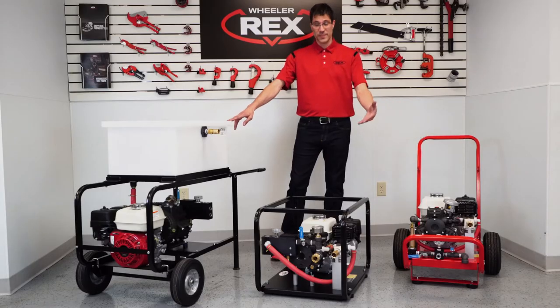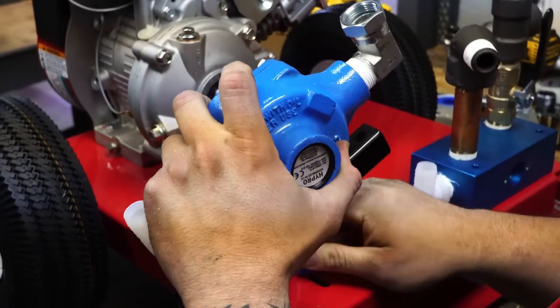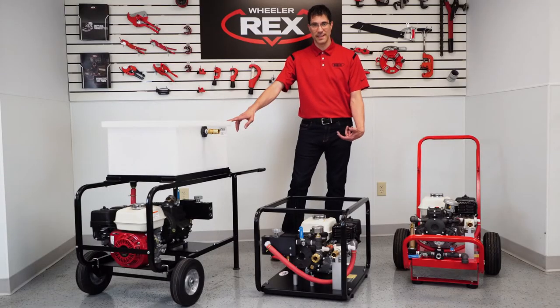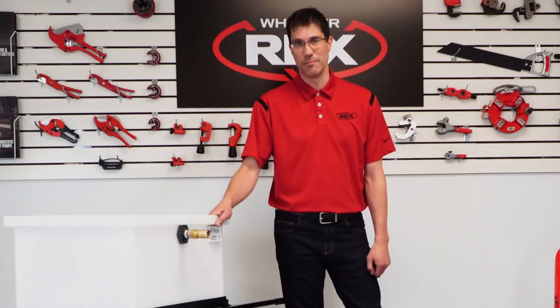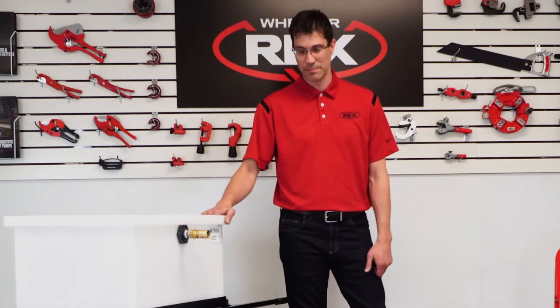The ideal way to feed the system is a gravity feed system. If you cannot gravity feed and you must direct feed, please do not exceed 10 PSI inlet coming in, as it could damage the diaphragms. If it must be over 10 PSI coming in, use the tank type model — it will fill the tank, the tank will gravity feed the pump, and keeps the pump safe.